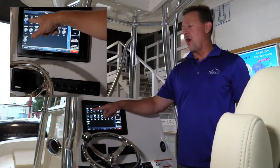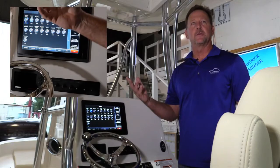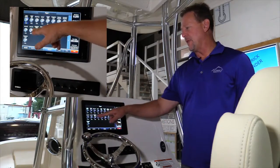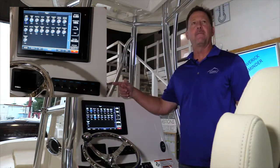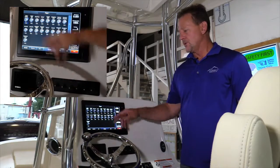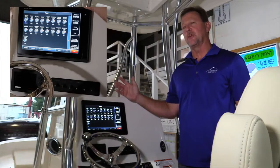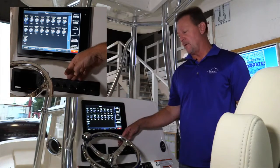Equally, you can turn on and off those circuits from the screen independently. So if I just want my anchor light on, I turn it on from the screen — no problem. Same thing with nav lights: when I turn on the nav light circuit, I'm actually getting both the nav light and the anchor light to turn on. So the idea is from the screen you have access to any button and any circuit you want. From the switch panel, we just have a few hot buttons that are important.